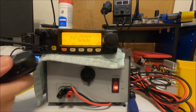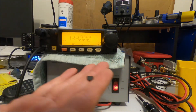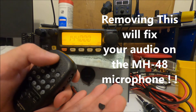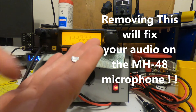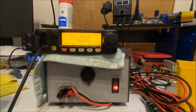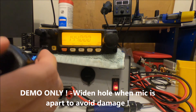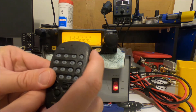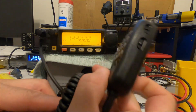I referenced George Donaldson's video — exact same symptoms I had. This is just a piece of plastic inside the mic, not a diaphragm, and the holes are very very small. What you do is take that plastic piece out — you can throw it in the trash. I used a very soft plastic replacement; you file it in for the electret element, making sure you put it in there with the rubber grommet that comes with it. Now we have full functionality: the lamp lights work, everything works, we can TX.